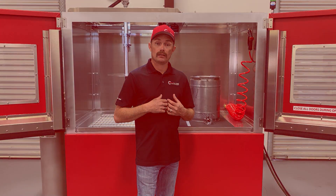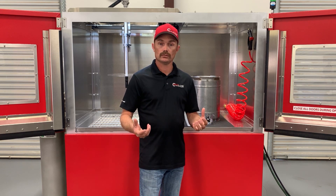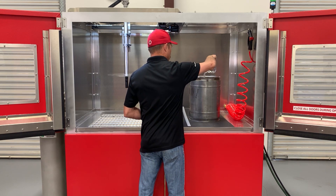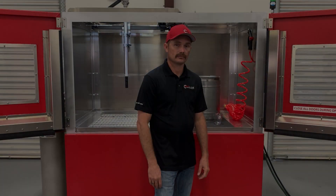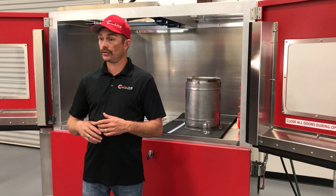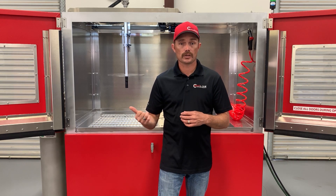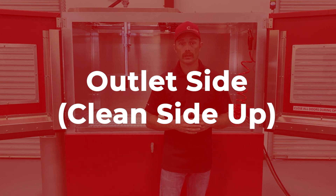Once we've added our surfactant, we're going to add water from the wash nozzle, which is attached to the clean tank. After the filter has soaked, we move it from the soaking station to the wash station by pulling the filter back towards us, letting the water drain to the rear of the machine — be careful not to push it forward or water could come over the front. Once drained, we move the filter to the wash basin, placing it with the dirty side, or inlet side, facing down, and the outlet side, or clean side, facing up towards the wash nozzle.